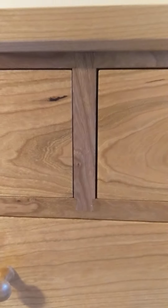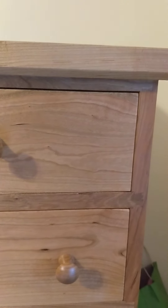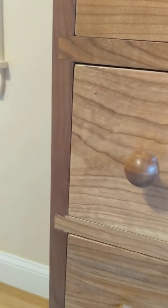The vertical stretchers between the drawers are all sliding dovetails — they slide into place and give the carcass a lot more strength. There are no nails joining the carcass except when putting the lower feet on. The horizontal stretchers are also dovetailed, which I had never done before — quite interesting.